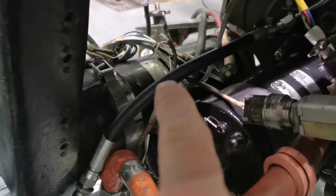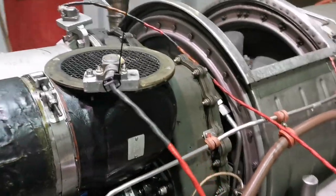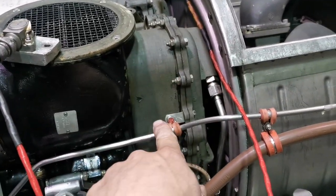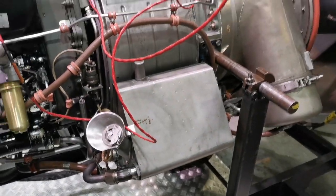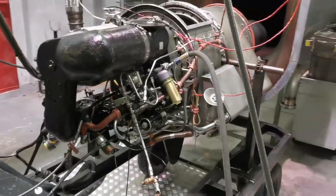There's your oil pump down there, and you have an oil cooler in there and the starting motor here, so obviously electrically started. Then this is your cooling fan here as well, which, it has to be said, are prone to leaking oil from the shaft, which is not an unusual problem with these APUs. This is the accessory drive gearbox, and then this here is your oil tank. This would be a dry sump, I suppose you could call it. That's basically a walk around of it.